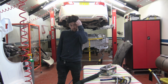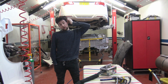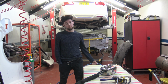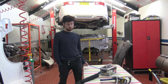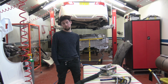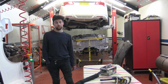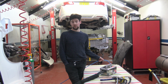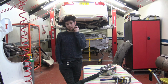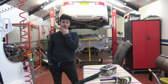The system transformer is very high current. There are many components on the low voltage side, controls such as for pulse, on delay, off delay, hold time, and all that stuff that's situated around spot welding. Approximately 90% of these components are cut and shaped using little machines. So I've handcrafted them using hand tools, grinders and files and stuff like that.